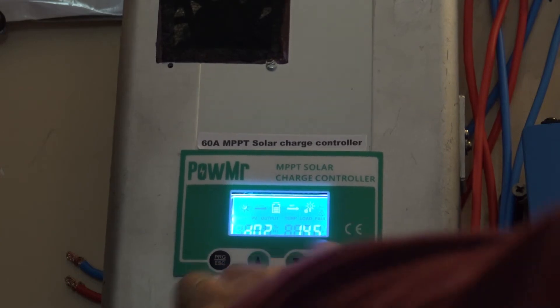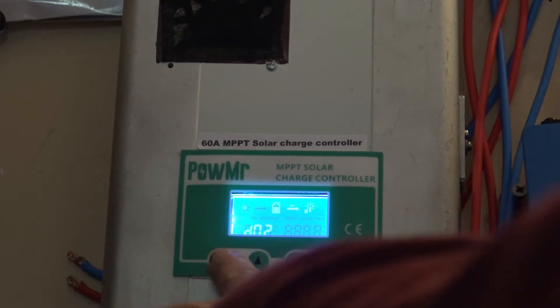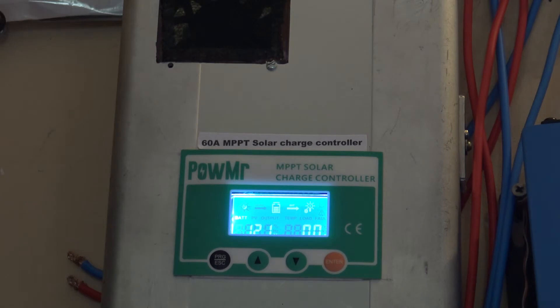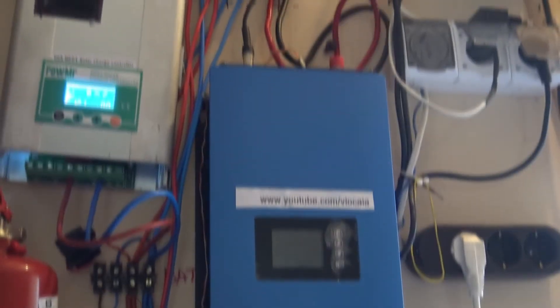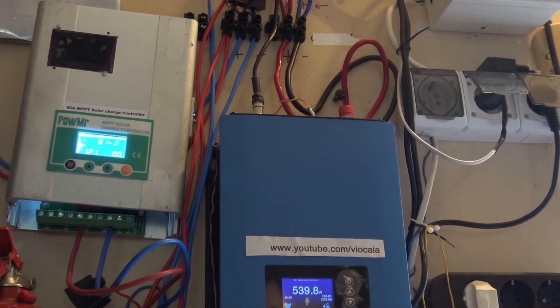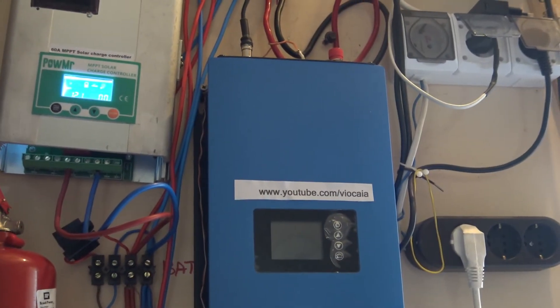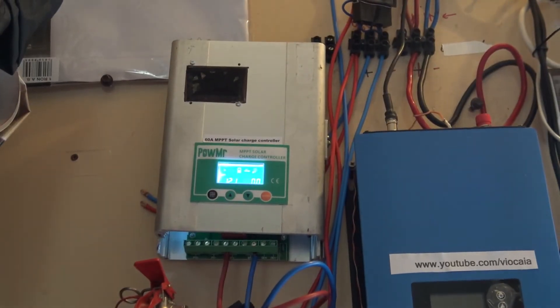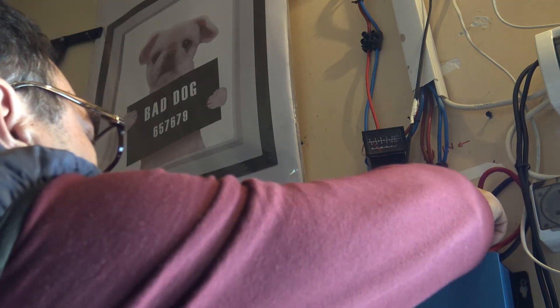14.5 — I don't like this, maybe I should put it to 14.4. Enter. Next, I'm going to use my solar panels for the inverter here, so I'll have around 34 to maybe 40 volts or something more. I have more than 900 watts available, but it doesn't really matter — it will just be a test to see if this MPPT charger is really delivering 60 amps to the batteries.